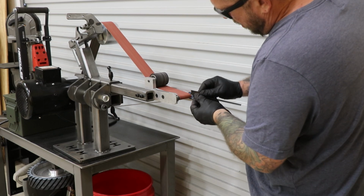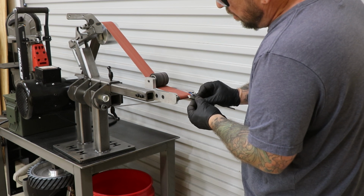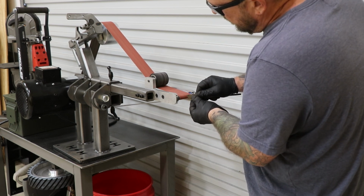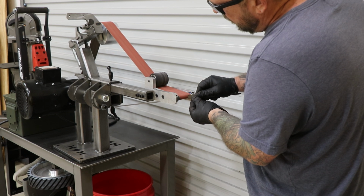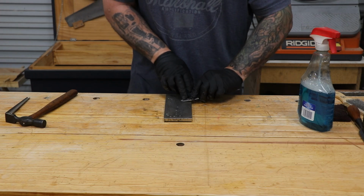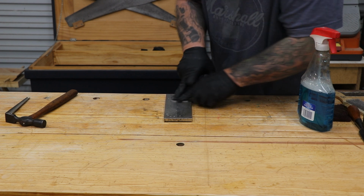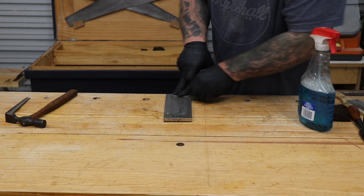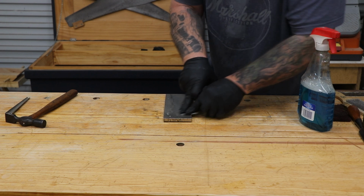While there are plenty of methods that can shape this iron pretty well, I happen to have a belt grinder with a small wheel attachment that I can use to match this profile pretty quickly. Once a bulk of the profiling has been done with whatever method of grinding you choose, the next step is to go to some sharpening stones and flatten the back of the irons.